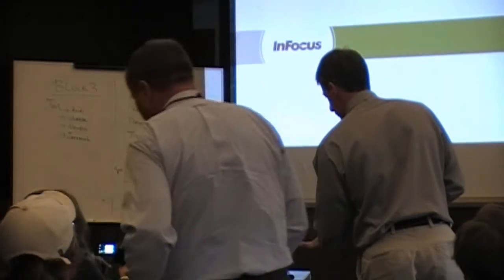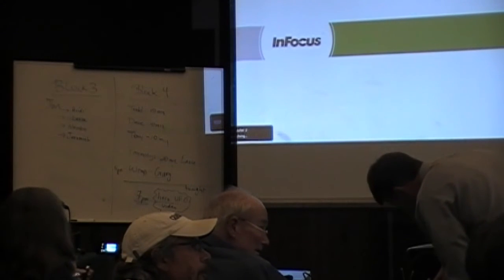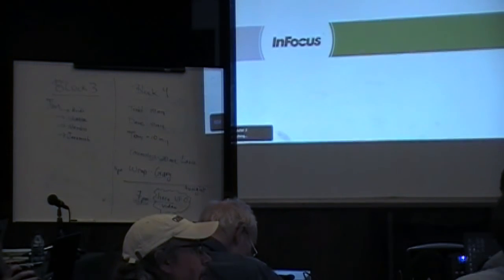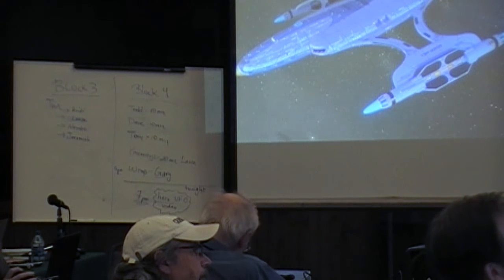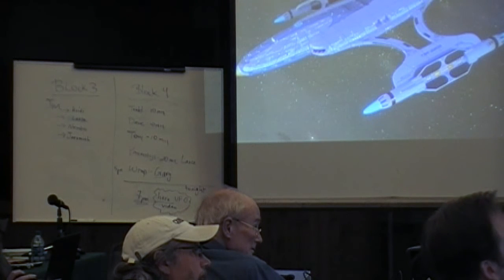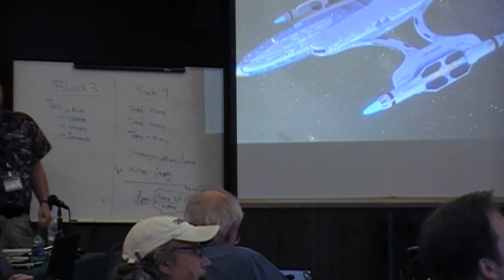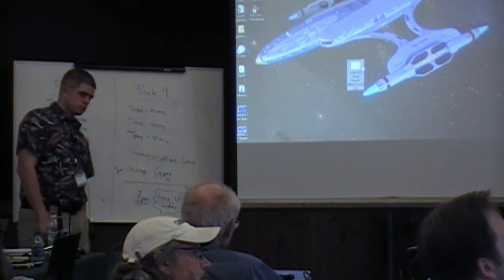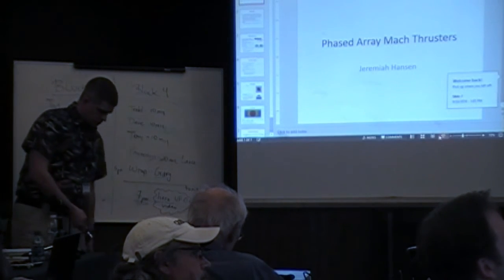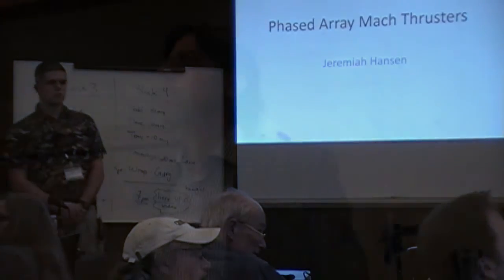I'd like to make one comment. When dealing with Galinstan, or any liquid metal contact, one should be aware of Ampere forces. In high current applications, currents flowing through liquid metal conductors produce circulating forces, which can exert a little bit of torque on a pin in a pot of liquid metal. If your center pivot is off center, those forces can be magnified. And if you bring the current into the pot from one point and take it out from the center, sometimes there are additional forces.